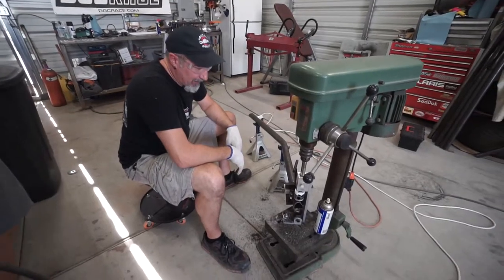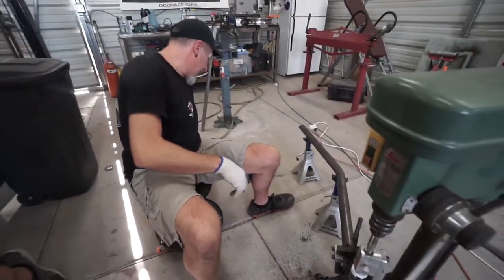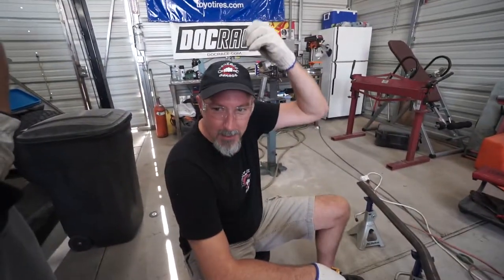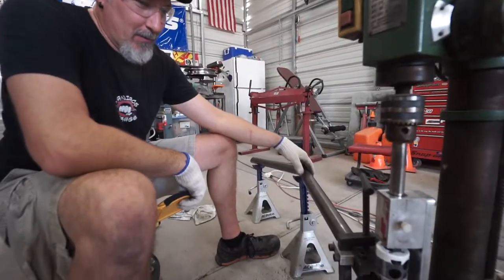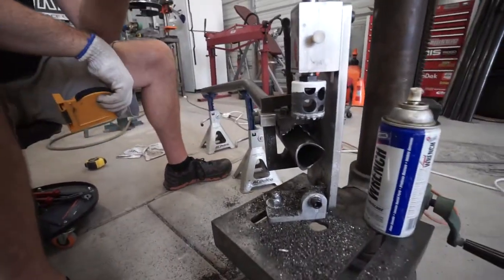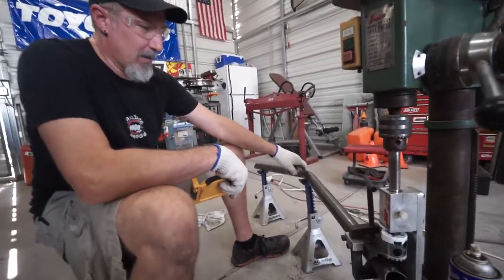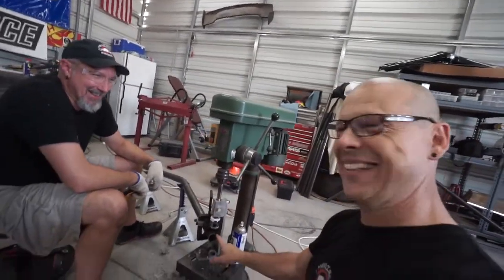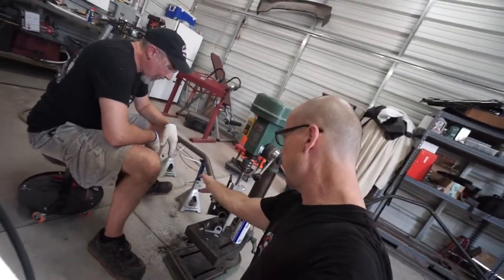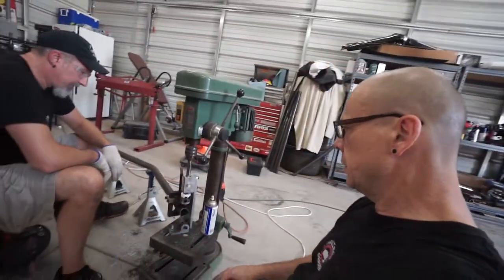I gotta figure this out — we've got a tube at 45 degrees and tipped, so I gotta think about this for a second. You can see the gears grinding — this is why you get paid the big bucks. If you change this angle, that changes the angle to the side and we don't want that. We just want to come down through at an angle relative to our bend. The angle to the dangle should be about 10 degrees — get this plane to the ground, get it horizontal, drop the back end over there, and then get your 10 degrees right there.